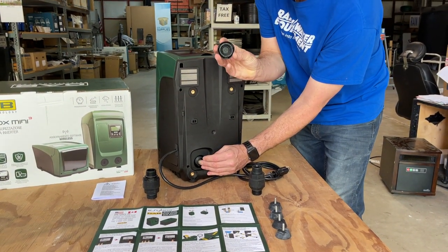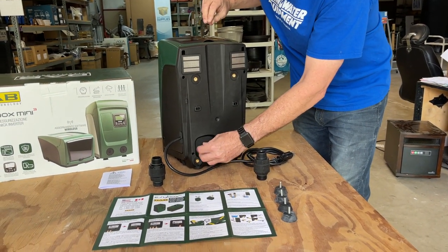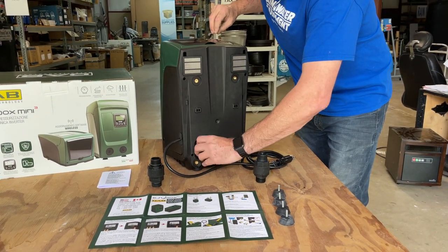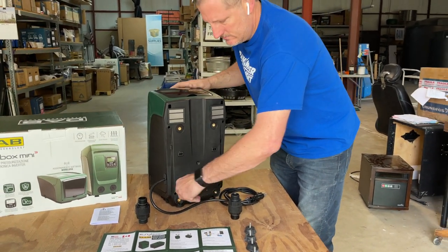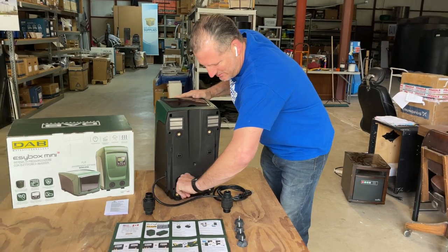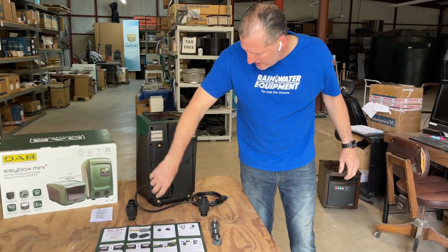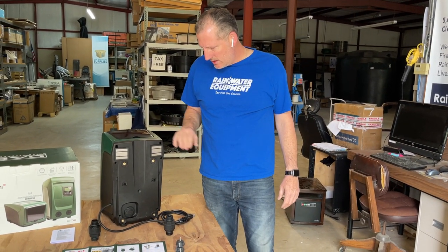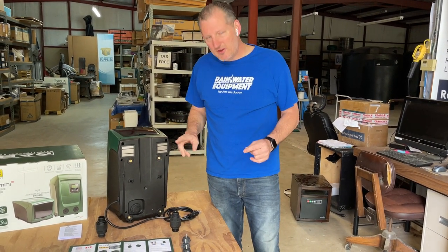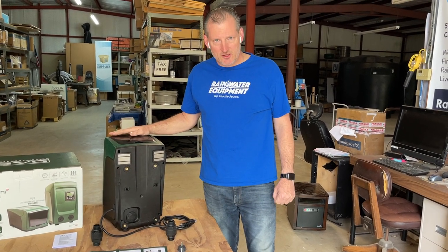Put the mechanism back in the pump with the spring on the outside. There's an O-ring inside the cap, and you push against that O-ring, then screw it on hand tight — to about right there — and stop. That will not leak. So again, this video was about how to switch out the shutter valve facing a different direction, following the quick start guide for flooded suction.